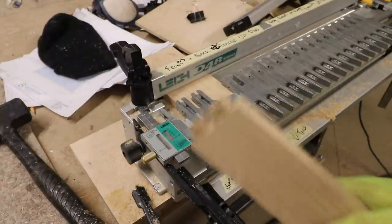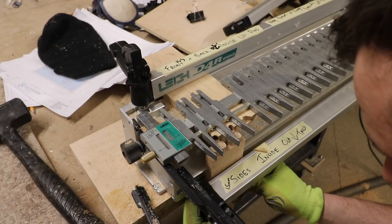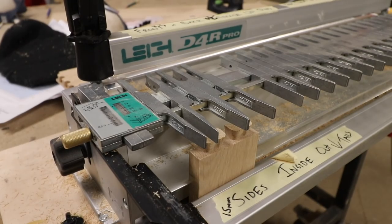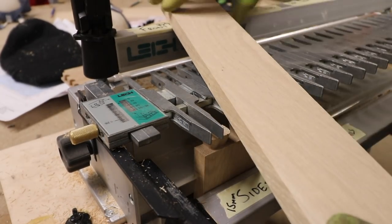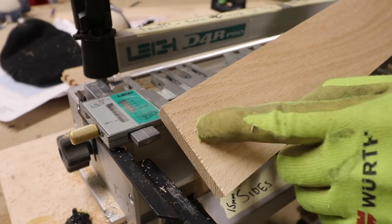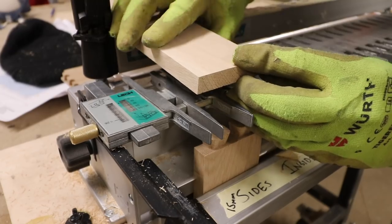Then I use one of the tailboards, sit it back in the jig, just at the height, just below where the cutter height is, so that the bottom of the pin board just seats up to it. And that's your reference point for the pin board. Again, face up, so this is my sanded face. The reason I said earlier about cross cutting, so the chaff from the cross cut here is on the underside. If any of that is protruding up when it's sat in position, it's pointing downhill, so not affecting the cut at all.